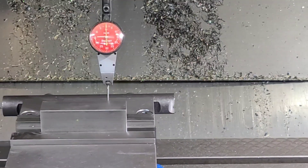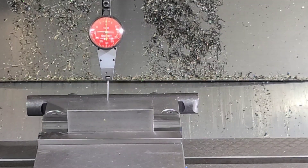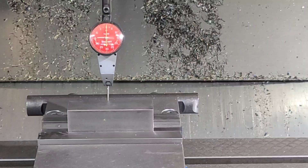We're pretty much dead straight across, and then up and down we're also dead straight. So we're going to put that slot in. I'm not too concerned about making this a precision slot — this is for a demonstration. If we wanted to, it would be using a rougher and a finisher and leaving stock. But let's put this slot in and I'll show you what it does. We'll throw the indicator back in there and see what happens to the outside of the part.